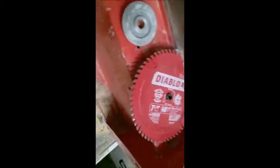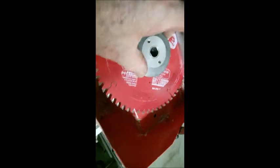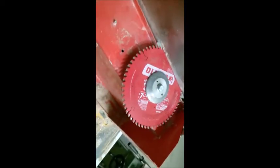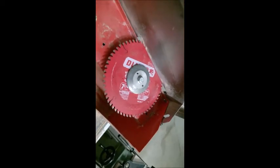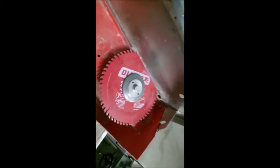That adapter allows you to fit a standard saw blade with a 5/8-inch hole. The outer piece you can reuse — that's the part that came with the saw originally. If you don't have access to a metal lathe, you might be able to fabricate something with tubing and a washer — I'd be real careful with that — but you might be able to work something out. However, if you can get past this hurdle, you're well on the road to having yourself a nice little table saw.